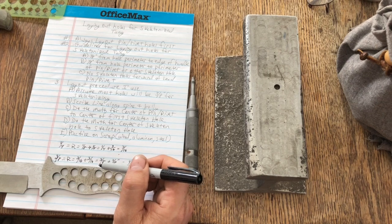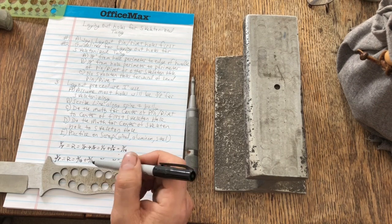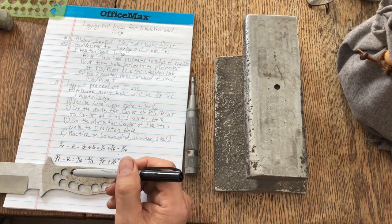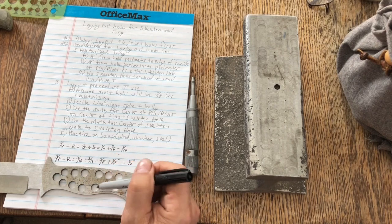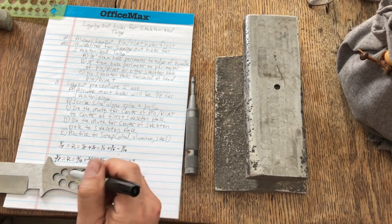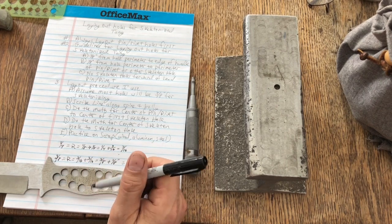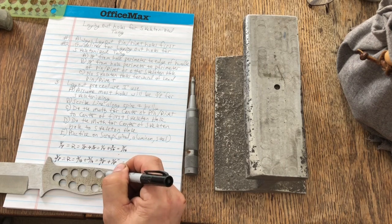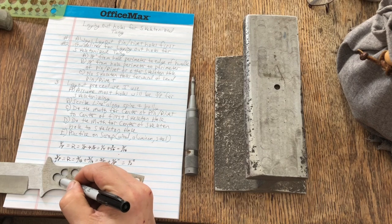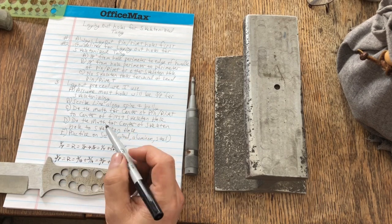Also, I want to comment that some people will not lay out their skeleton holes. They'll just take a drill and drill random holes, and the diameter and size of the holes are all over the place. I've seen them where they don't care if there's an 1/8 inch web or not. I'm telling you, this is a bad plan, having less than 1/8 of an inch and getting a stress fracture there.